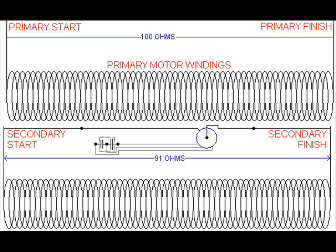We're treating these two coils as two separate generators running through diode bridge rectifiers and then coupling them down. We hooked the outputs of the diode bridge rectifiers into two wires and send it down to the battery, which acts as the voltage regulator. From there we can use our power.